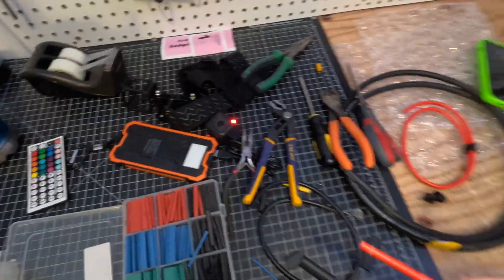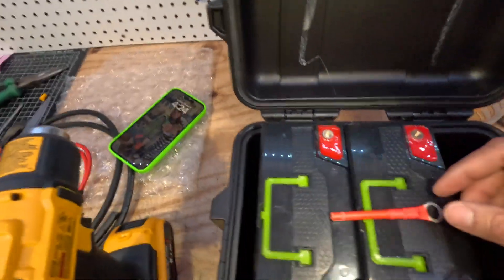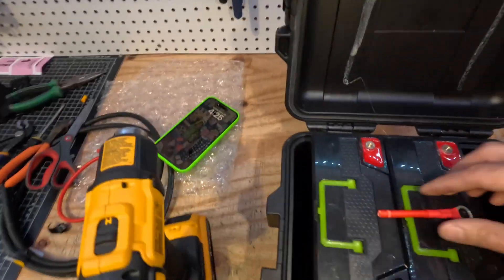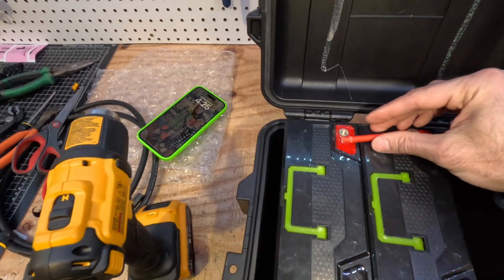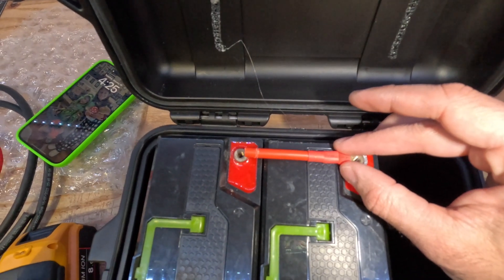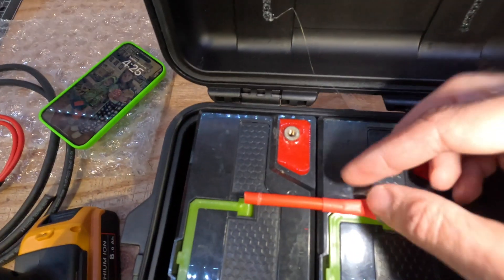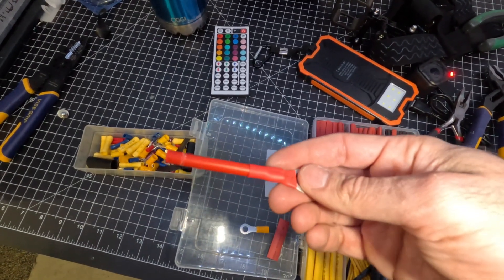So let me show you what I'm doing right now. I ordered some eight gauge wires with ring terminals off Amazon — I'll put links to everything in the description. Basically I can't use the whole piece they gave me because it's pretty big and bulky, so I'm cutting it down so it fits snugly in here. If I have the whole wire I can't shut the lid. So I'm cutting it to just the right length to have the batteries connected in parallel, then I'll trim it and add some heat shrink and another ring terminal and it should fit nicely.